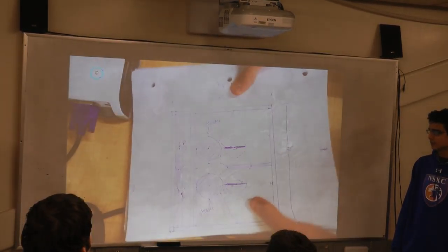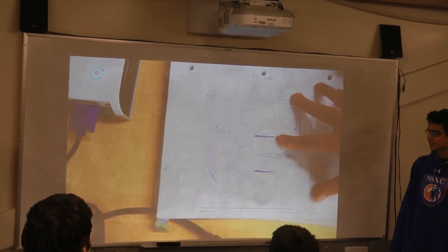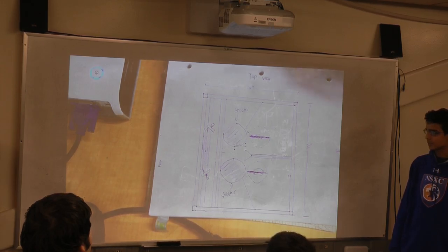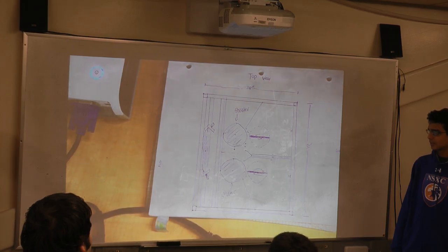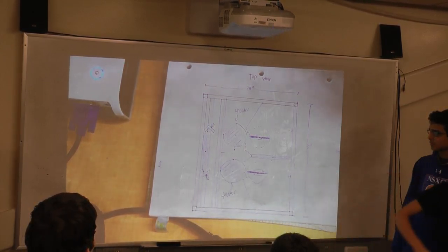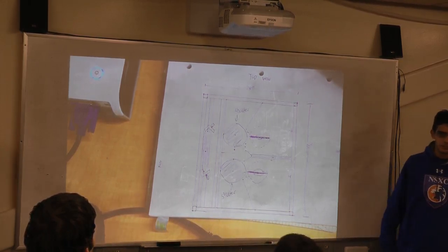This is the top view. We did decide to use two independent shooters. We thought that was the best way to achieve a high frequency of balls entering the robot. As you can sort of see, there are ramps that push it all in. L means low and H means high, because I can't draw gradients, so that's the best I could do. And then these spinning things are just little rods that spin, and that's going to stop it from jamming, which are probably agitators.